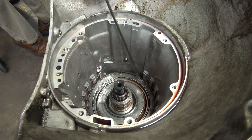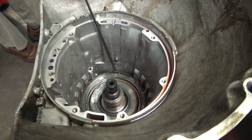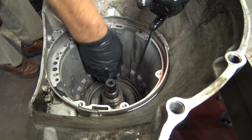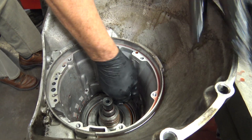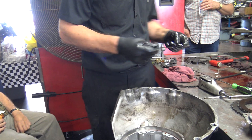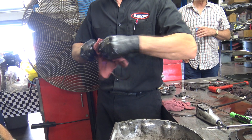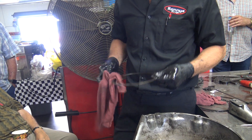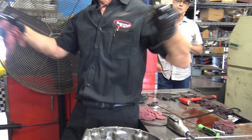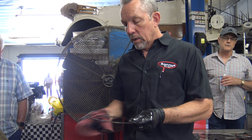I don't know if you guys are like me, but I try to forget my mistakes. I have learned not to as much as possible. The reason I'm sharing that with you is not to make you think I don't know what I'm doing — everybody is human and sometimes you make a mistake. The key is to own up to your mistake and deal with it. Now this snap ring — I want to pass this around so you can see it. It's got a chamfer on it. What I did is I put this one in the wrong place — I think I put it on the top — so when pressure went against that big plate, the chamfer allowed the snap ring to move that plate and it popped out of place. That's why I had a problem.